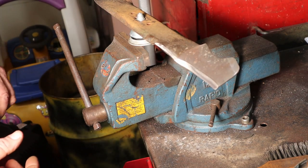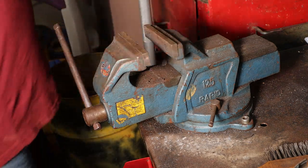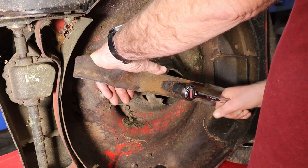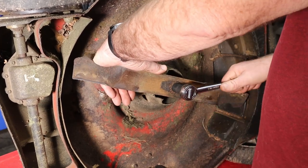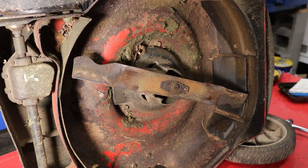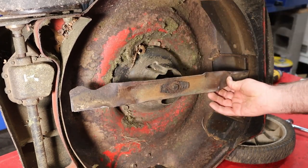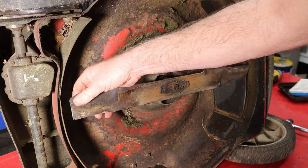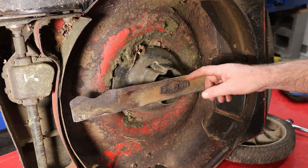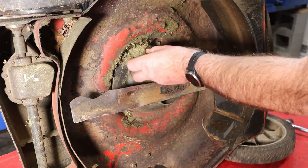That's pretty stinking good. I use a flappy wheel on these instead of just a grinding stone, and I like that better — it makes a nicer cutting edge, you don't burn the metal quite as much, and it just doesn't remove it as fast. I kind of like that.